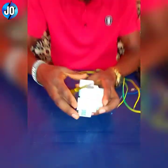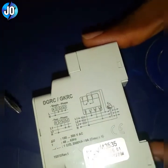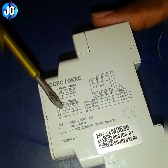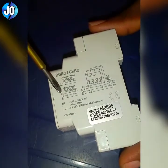When you look at this voltage monitor, you see that the diagram of connection is on the body. When you look at the diagram of connection, you see that when you are connecting a single phase, you have to bridge L1, L2, L3 — which are the three live phases — and you have to use neutral. When you are connecting with only two phases and the neutral, bridge two of L2 and L3 and connect the other one to L1; the neutral goes to the neutral position.